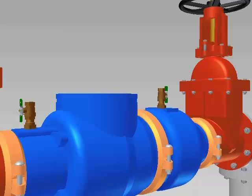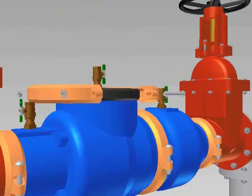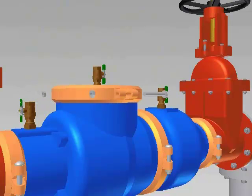Place the groove coupling gasket over the valve opening. Lubricate the outside of the gasket. Replace the cover and reassemble the groove coupling. Make sure the coupling is seated properly and the ends of the coupling halves touch. Close the test cocks.